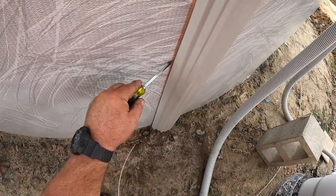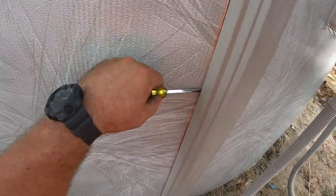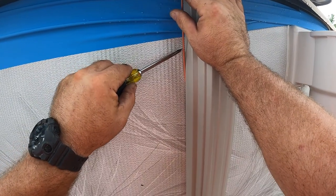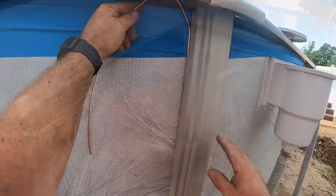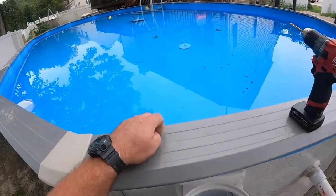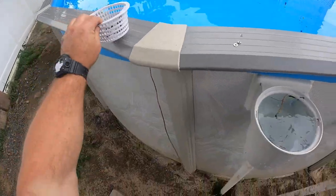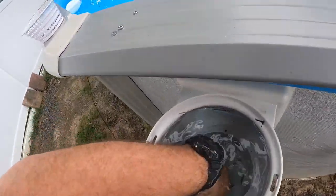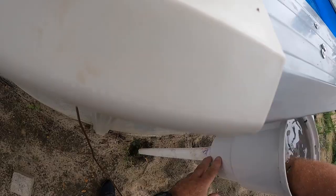I'm hiding that bare wire behind the frame of the pool to make it look as neat as possible. I think I was a little bit short on wire, but this bare number eight AWG copper wire is going to go right to that skimmer. I'm going to add a metal plate which will mechanically bond the water itself. I'll take out the basket and do a dry fit first — you have to make sure this plate is in contact with the water at all times, so you put it at the bottom of the skimmer.